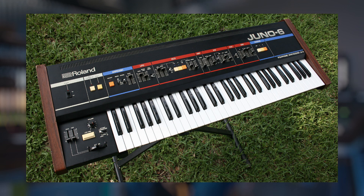Let's look at a couple of other differences. The stem in the new pot is a little bit different because it's got a slot in it — that makes no difference whatsoever; otherwise it's the same size, and the slider cap goes right on, exactly the same. The difference, though, is on the business side. They have almost the same footprint but not exactly. The new slide pot has four solder pins in two pairs, and they are very slightly tighter together than they are on the original.